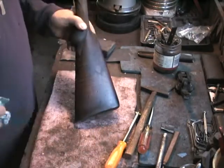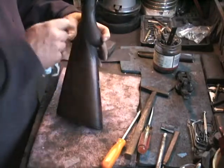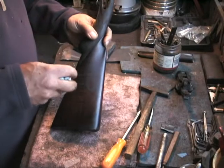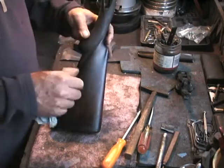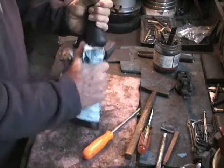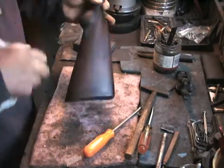There's really nothing you can do about that other than a full refinish. So I'll just let that dry again overnight. I'll come back tomorrow and sand again with some oil and some finer paper. At that point — the second sanding — I'll actually rub everything off, and from then on, if the pores are filled, all I'll do is apply oil by hand and rub it in, giving it several coats until it looks good. On old wood like this, three or four coats starts to look okay. On new wood or wood that's been totally refinished, you're talking a dozen coats before you get the surface sheen back.